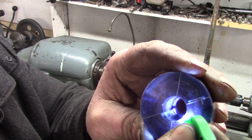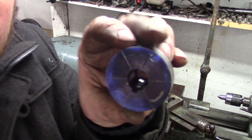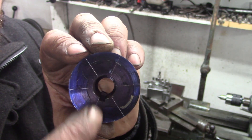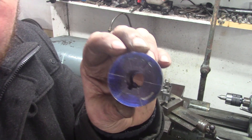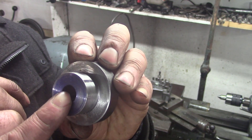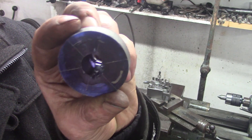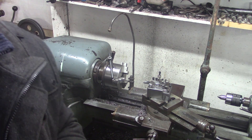That chip I'm producing isn't breaking away, so what I'm going to do is get in there and cut a relief at the back of that bore, just before the shoulder. If you picture the cross section, the surface is going to basically dogleg — go along where I'm splining, then there's going to be a relief, and then it's going to end in a butt where the bolt comes through. It's got to stay at minor diameter here so there's something to secure this on the spline shaft. But the chip's just not breaking off, and every pass I take it's leaving a longer gap where I'm not cutting the slot.